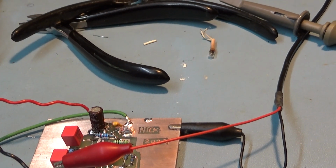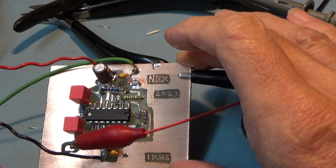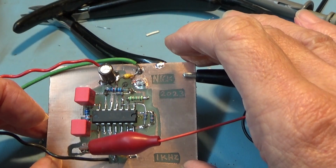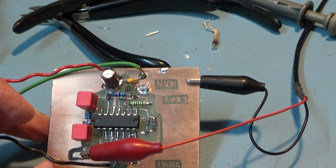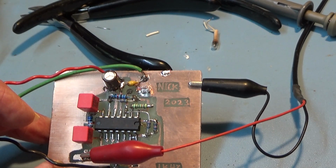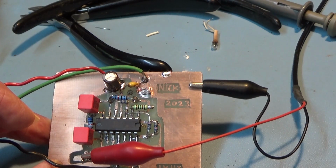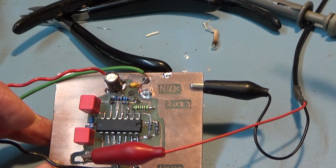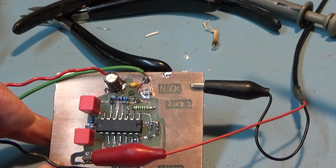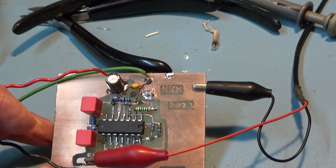But I think it's quite impressive all the same to produce such a low distortion 1 kilohertz sine wave generator for probably not much money. I mean, what's the most expensive bit? Probably the op amp. Capacitors are quite expensive, 2.5% tolerance, and 1% metal film resistors throughout. And I've tweaked the frequency by paralleling a resistor on one of the 16Ks. It's not quite 1 kilohertz, but it's 997 at the moment. Well, that's good enough, isn't it?